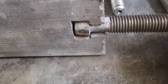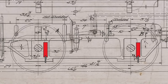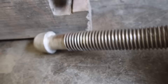Now it's time to make adjusting bolts for the wedges on this locomotive. This is a wedge — it slides up and down at the back side of the frame and is moved by a screw. For the most part these existing bolts are bent, the ends aren't very good, and they're homemade. Only one is actually usable; the other three were either cut off to get them out or are bent and damaged. I started with a piece of A36 one-inch stock, turned down to three-quarters of an inch, with a relief cut that gives something to thread into. I'm making up four of these, starting with cutting the threads.